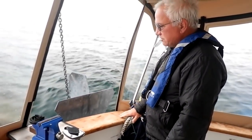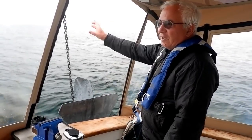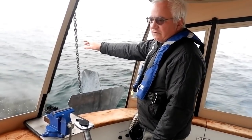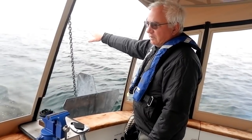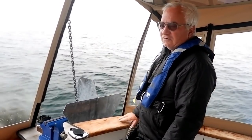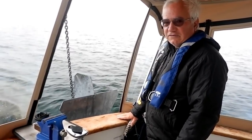If I were to launch, I would do exactly the opposite: I would lift it a little bit with the crane, drop it, hold it out, and let it go down into the water. As soon as it gets into the water, if we're underway, it pulls away from the boat and goes into its normal trim position, and then I just lower the line until I see that the chains are straight off the poles. And that's it for this section.